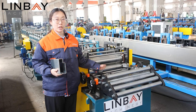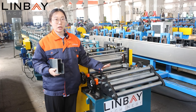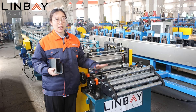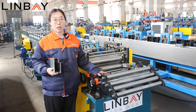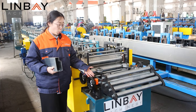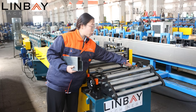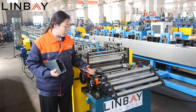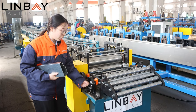This is the guiding part of our roll forming machine. There are four guiding rollers. These guiding rollers can keep the steel coil and the roll forming machine on one same center line, maintaining the straightness of the steel beam. Here is the digital display — we can see the gap width between the two guiding rollers on the digital display. It's very convenient, and we can adjust the width from this roller.